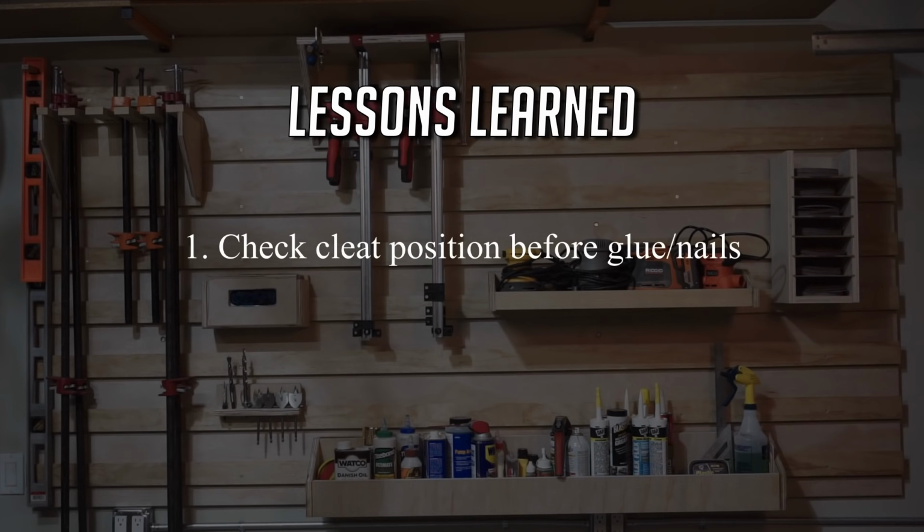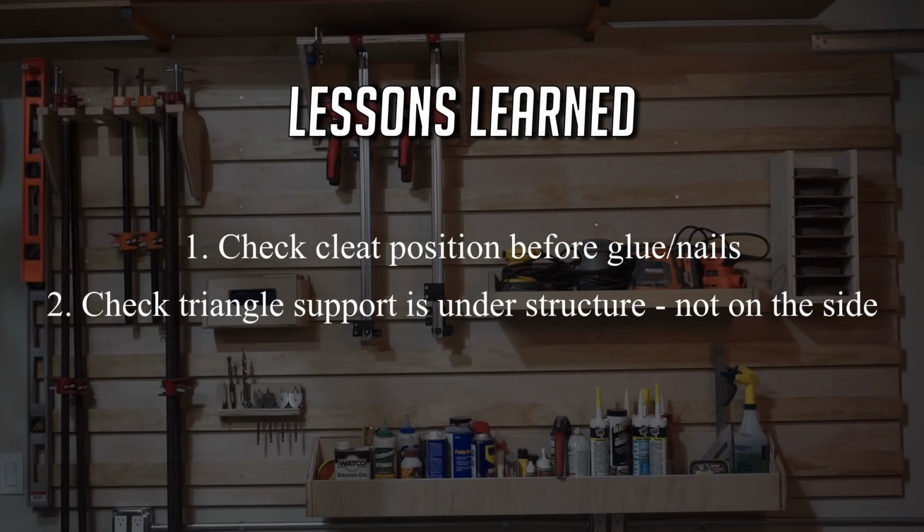Number one, check the cleat position before you glue and nail it to a tool holder. There was one where I didn't really think about what I was doing and just attached it, and it was on the wrong side of the tool holder. So hold it up to the wall as it's going to lay against the wall, and make sure you have it oriented correctly.